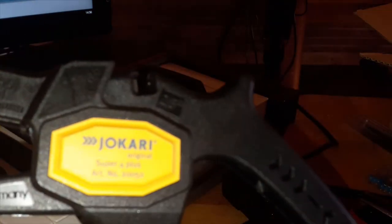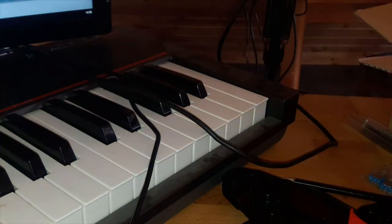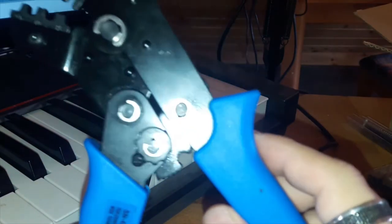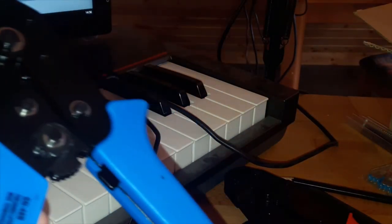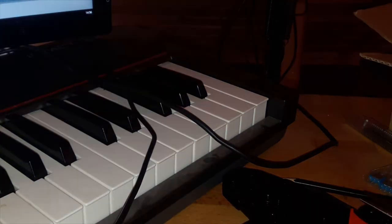The tools you're going to need are a wire stripper, a wire cutter, a pair of pliers — preferably with a precise tip — and a crimping tool. The one I'm going to use is the SN48B. Other people use the SN-20-something-B. The only difference is that with the other one you can handle slightly smaller diameters, but for this type of application both will do the job.